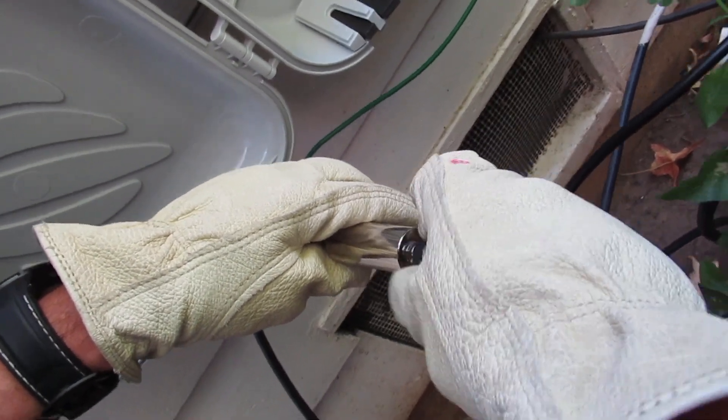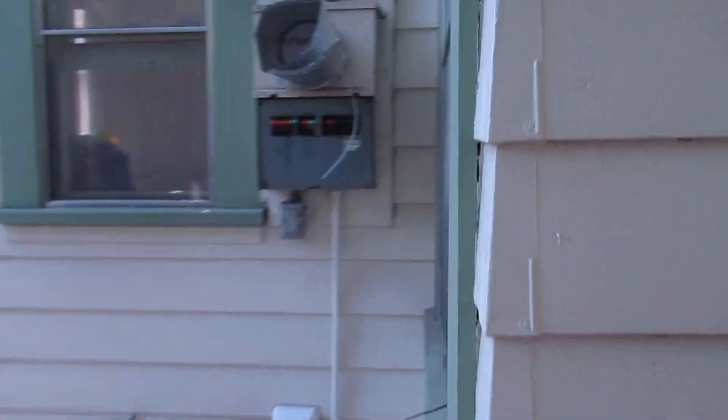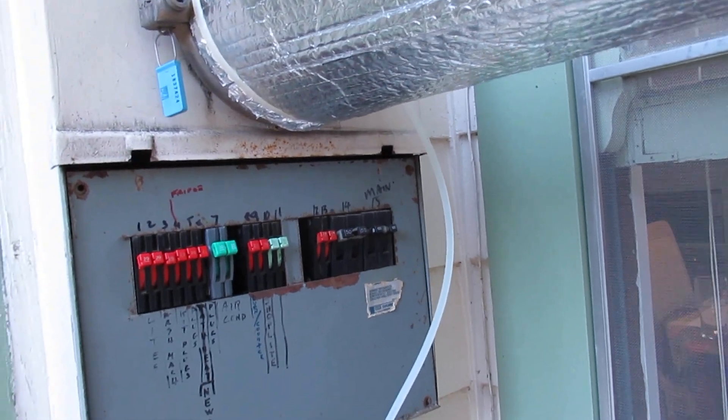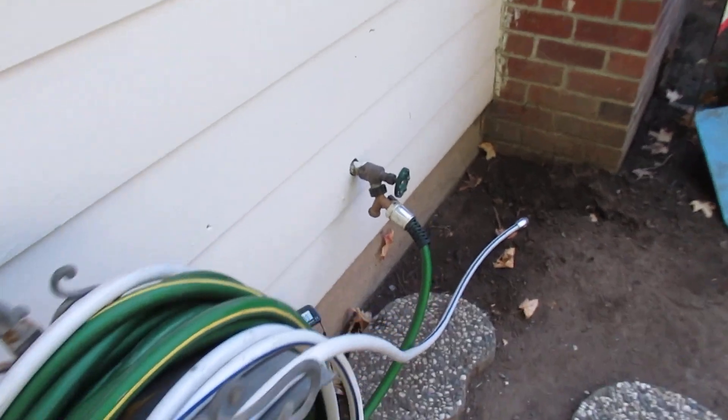Really, Comcast should be doing this, because in this case the Comcast line is coming in from the street at the easiest possible location right here, and by code it should be connected all the way back to the main panel. But instead, the electricity on the Comcast line is going all the way underneath the house on the water pipe the whole length of the house. In my professional opinion, what happened is Comcast hooked it up the easiest possible way and grounded it to the customer's water pipe right here. Now, you can hear the field meter barely clicking — it used to be going much faster. We solved it.